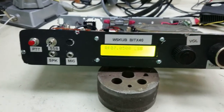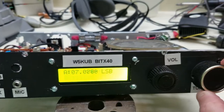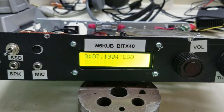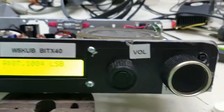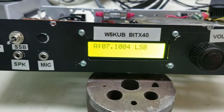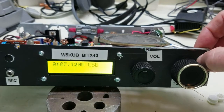Normally on the Radio Uno, when you turn the dial all the way to one end, it starts automatically going up. Well, you can see here I'm at the end and it didn't automatically go up. What I did, like KE0OG did, was I put two push-button switches here, and they connect to the tuning pot. When I get to the end, I can press the up button, and you can see the frequency steps up.